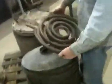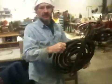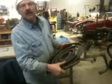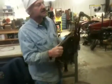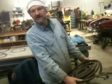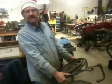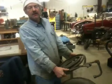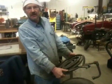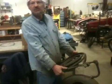Typically your superheater is made of a heavier material, like Schedule 160 black pipe or stainless — this one is stainless. It'll take much higher temperatures and it's stronger. However, the drawback with stainless steel is that heat transfer characteristics are not as good as black iron pipe. That's why so many people use black iron instead of stainless. If you have a hotter fire, you can use stainless, because then the heat transfer characteristics don't matter as much — the heat will just transfer automatically.